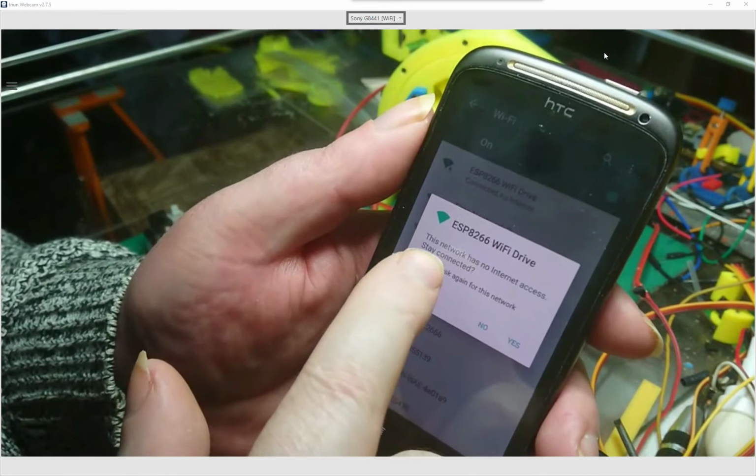Handle front view image. So then all you would do is, if the SPI flash file system is active, then you can get the image file, and it's just the image. It's a PNG, basically. You just tell it where it is. That's this bit here, and it goes to whatever I told it in here. There, that's it. So that's that image file.